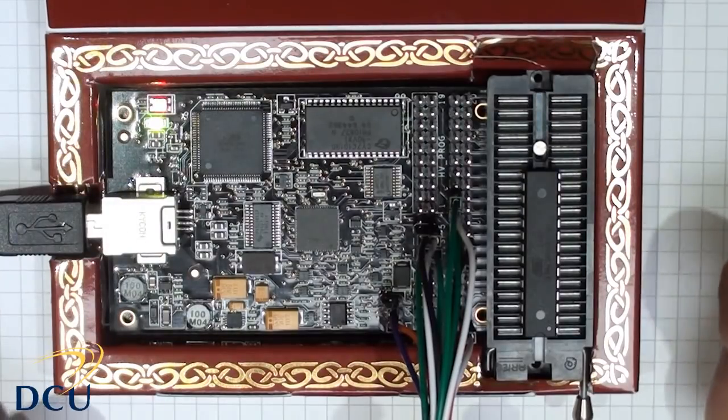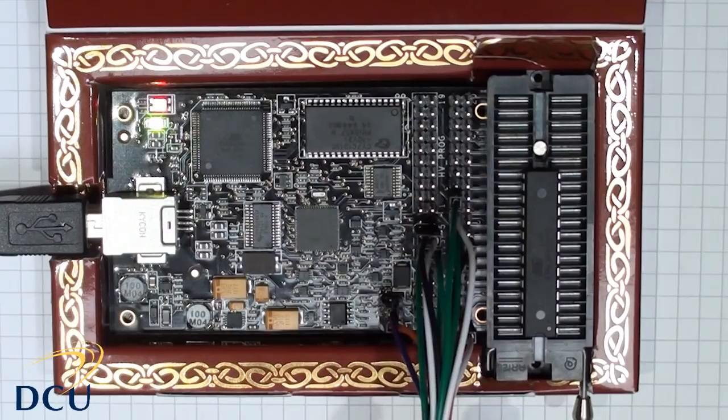I prefer AVR Studio 4 at the moment, and I use that in the next video to show you how to write some code. In this example here, I'm going to show you AVR Studio 5, but I found that there were problems with debug wire with AVR Studio 5 and the AVR Dragon. AVR Studio 5 is a very large download, about half a gigabyte. It uses a .NET framework, so you could maybe download that while you're doing your soldering.